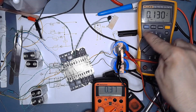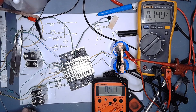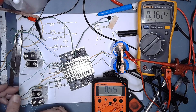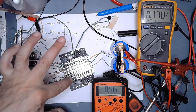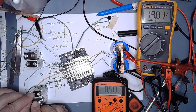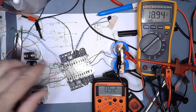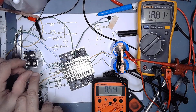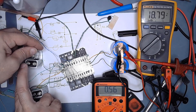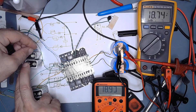There is nothing on the multimeter because the capacitors have been discharged. What I'm going to do is close each MOSFET — both of them, both of them — because they work in a twin configuration. Those ones work together with these two batteries. They are galvanically protected. You can see a voltage appearing on the first capacitor — this is the positive. These MOSFETs are commanded by those batteries, and those batteries make the other capacitor charge, creating the negative rail.